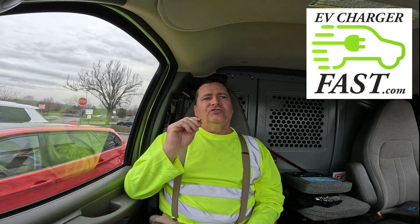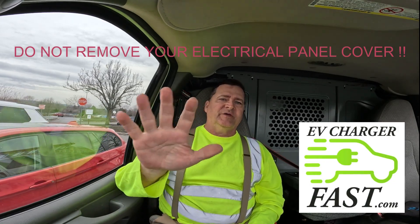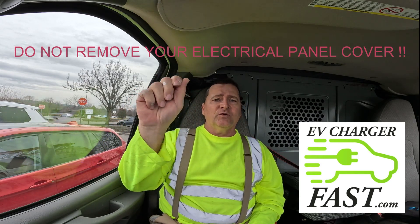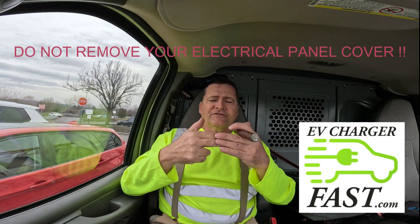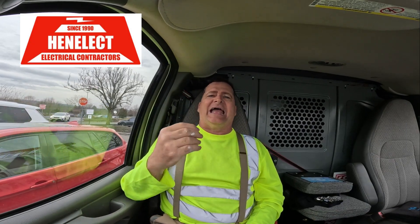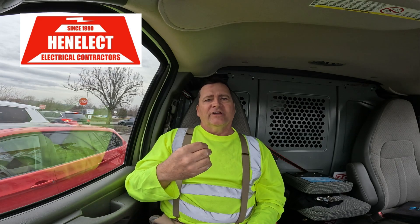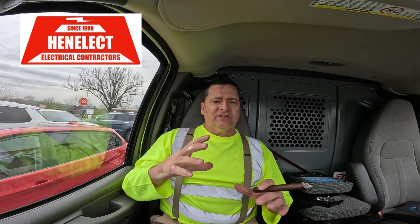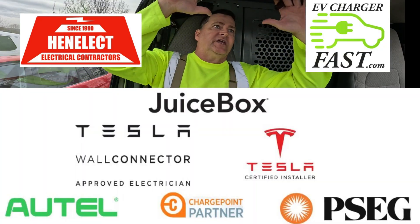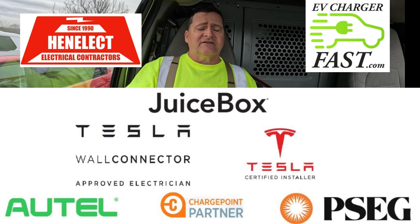I want you to look at your electrical panel. Open just the door — don't take the panel cover off — and rub the ends of your fingers over the breakers. Feel for any warmth. If there's warmth, call us, because you don't want to be adding big loads to a panel your house can't handle. Just because you see empty space in your breaker box doesn't mean you have capacity — especially if you have electric heat, air conditioning, or a swimming pool already drawing power.